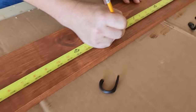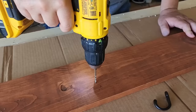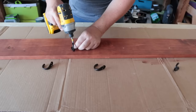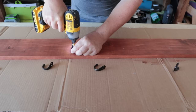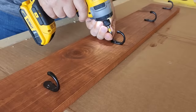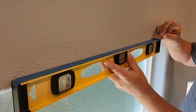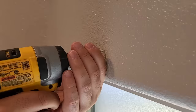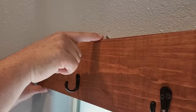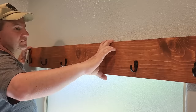Pre-drill each hole where the hooks will go — I'm a big fan of pre-drilling because it keeps the boards from splitting. Put the hook up, use the screws provided since they match the hook color, and do this for each hole. These hooks usually have two screws, so make sure you get both in. Now use that level against the wall, mark where you marked on the tape, and put screws in the wall at those two points — but don't go flush. Make sure the screws stick out a little, then slip the board's drill holes right over them. You won't see any screws through the board and it holds tight and secure.